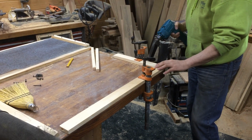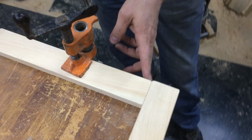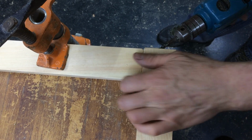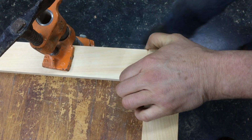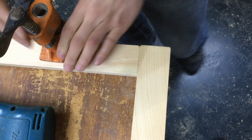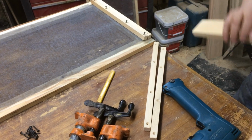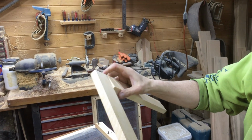And to hold them, what I do is I clamp them down and I offset it slightly. If you take a close look at this. Because what I'd like this even when it's done, but because the screw's going in at this way, it's going to pull that over. And if it doesn't, we can let it loose a little bit. There, you see how it jumped a little bit there? Okay, so that one's done. So we just go around and do those 4. Now what we end up with, because there's only one screw in the corner, it can do this. So it really holds it there, but it's still not enough alone.